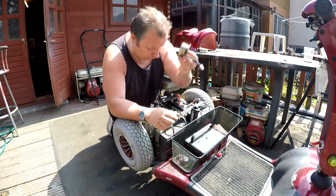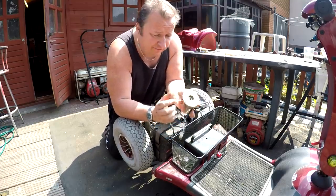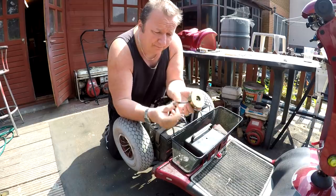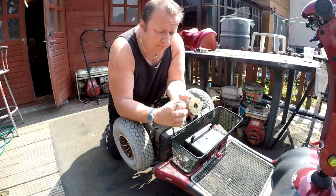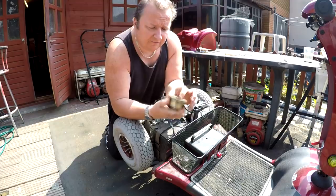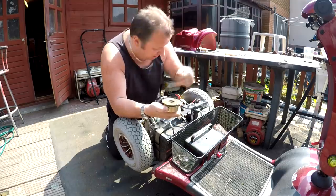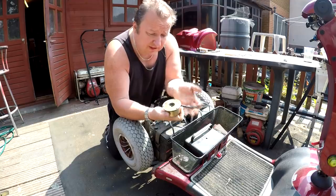This is the old brake now. I did strip this down — you can strip this down and clean it. I tried that three or four times because I couldn't work out why this wasn't working. All this is a coil of wire; the resistance seems to be okay — about 46 ohms when I measured it. The pins were nice and free, and if I lever this open it frees off that center spigot, which is what holds the brake on when it marries up with the shaft on the electric motor. But when you apply 24 volts to it, it didn't want to know.